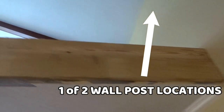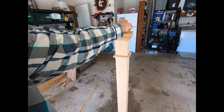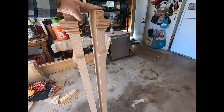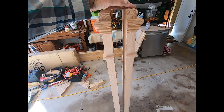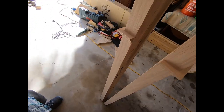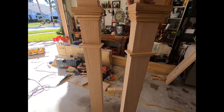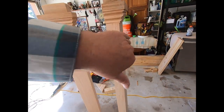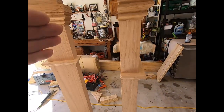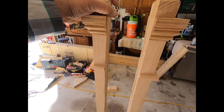We're ending with one as well. You know what we could do — we could take the wall one, cut it in half long ways, and put half here and half of it here. That's a good idea. Prepared to be amazed — I'm no magician. Wait, that's another video, but check it out. I just split our post into two long ways, right down the middle. We're going to use each half of it against the drywall where the railing ends. Instead of just using a wall plate, we're putting a whole post up against it. This part always has a space between here and the drywall because it never sits flat. But now this will sit flat against the drywall, and we just gained an extra post — I turned one into two.